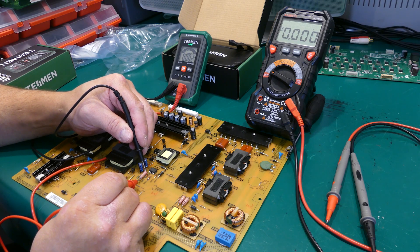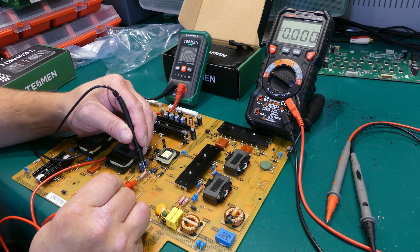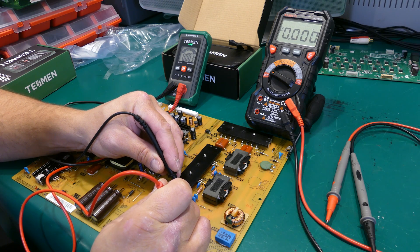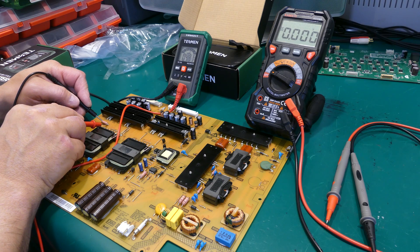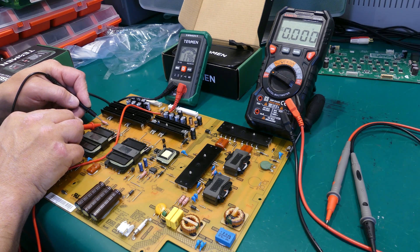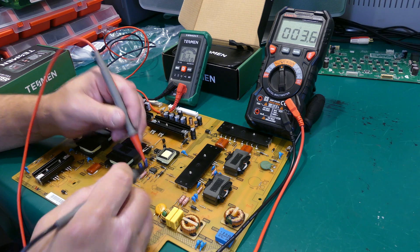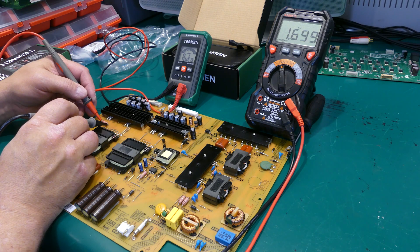Back to the resistance: the auto mode is going into continuity mode for all but one of the resistors. For the last one that doesn't beep, it measures the 2.7 kilohm resistor at 1.16 — which is normal because it's in a circuit board. My meter is doing the exact same thing but doesn't beep since it's in manual mode, measuring the last one at 1.2 kilohms.